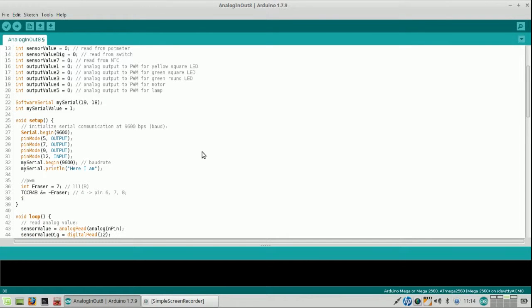Then I have to use a so-called prescaler, which actually sets the frequency. And now I have to take care of the frequency itself. It is in a range from 1 to 6, but each number denotes a frequency, and the fischertechnik motors has a range, as already mentioned, between 40 and 120 Hertz, and that means that I have to look at those values. Now 4 is 120 and 5 is 30 Hertz. So what I'm going to do first is use prescaler 4, which is, as said, 120 Hertz.